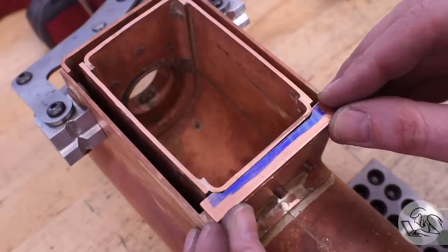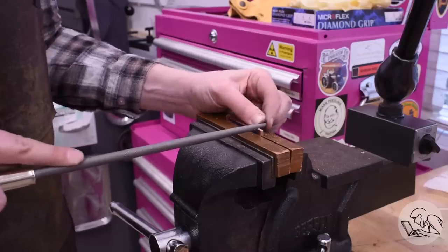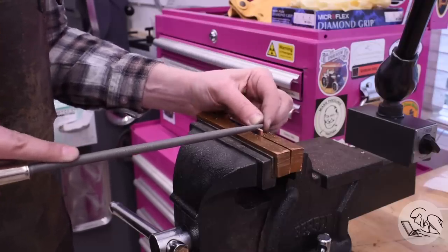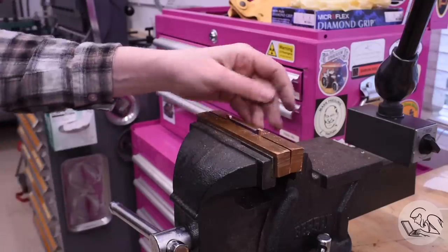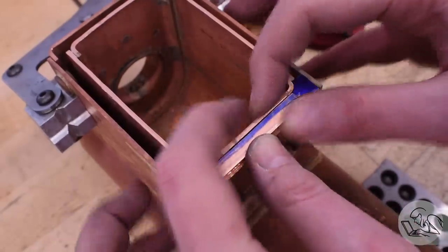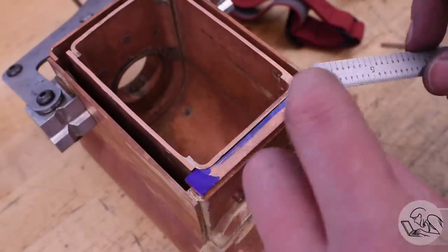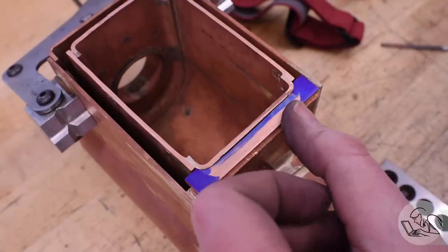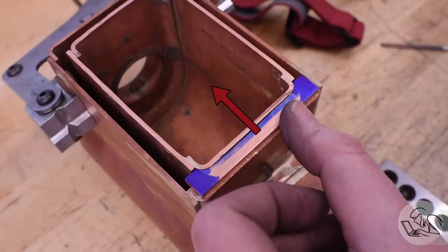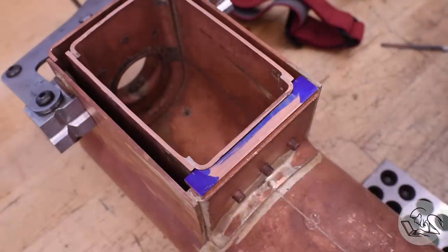Very close now — I just need to widen that a little bit there. Back to the round file, but now my hand pressure is outward because I'm trying to widen that shape without deepening it. Now I've got the curvature where I want it — that's a good fit. But I still have some slight gaps above the piece where it meets the flange on the side of the firebox, so I need to shift the entire piece forward a little bit — rather like scribing a baseboard in a room. The goal then becomes to deepen this U-shaped profile without widening it. I'm also starting to work on the far side of the piece, and I need a slight angle filed into it for that.